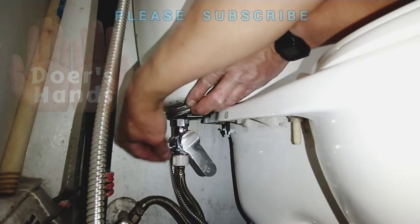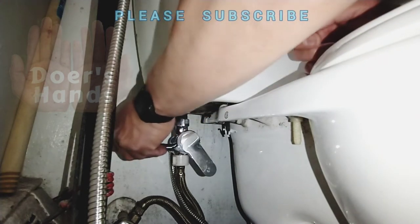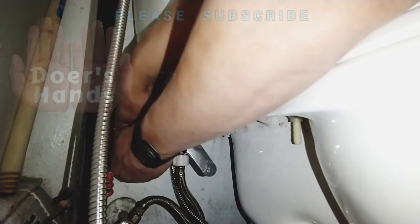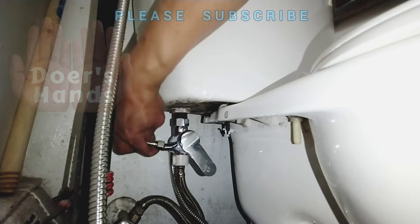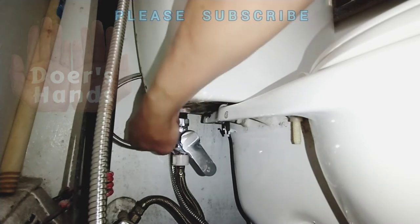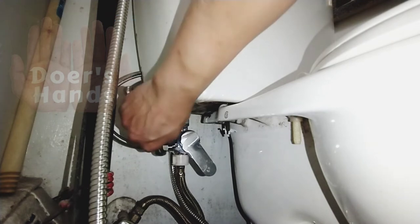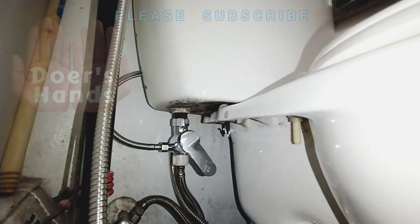I'm going to remove this cap for the hot line. We'll put this line in. Hand tight will do, unless you have a good wrench. Make sure it won't leak because there's a rubber o-ring there. You can add a little bit of force using a small adjustable wrench. Snug only so that you won't damage the o-ring. There, it's all ready. Now we will go back to this end.